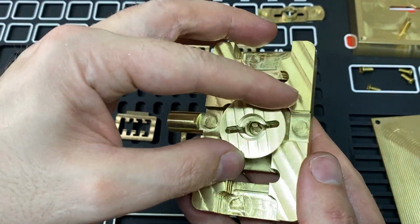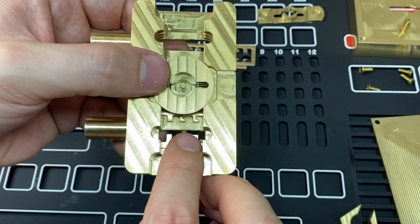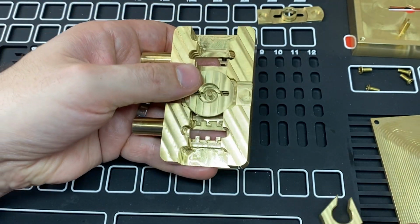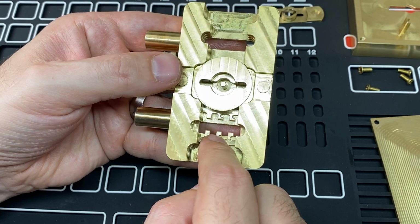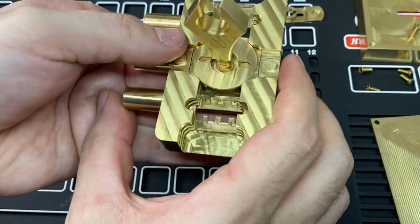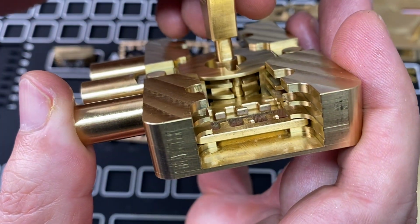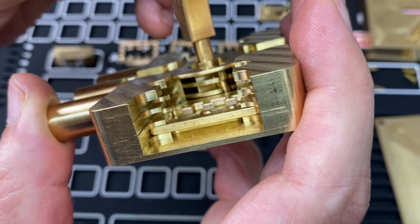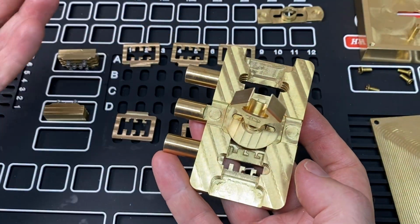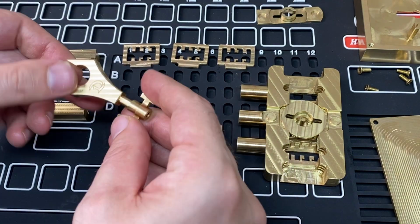So yeah, you can see, just to reiterate how this works, you have your stacks of wafers in here. There are 6 of them, top and bottom, each with 3 gates, and each of the little stumps here have those false gates to trap the wafers against the bolt stump, those little C-shaped cuts. The key, when it's inserted, will, as it's rotating round, lift up the wafer by an amount relating to the height of the bitting on the key. And you see the key coming round, and you can see the bitting exposed there, and that will happen top and bottom for all 6 wafers in those rows. It's a really cool design, and I can't imagine how I would go about picking this.